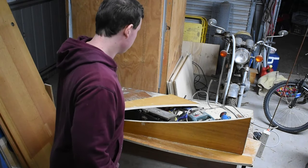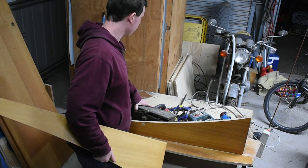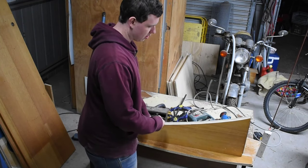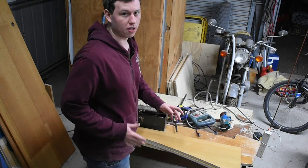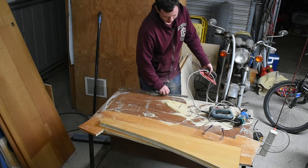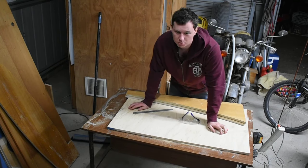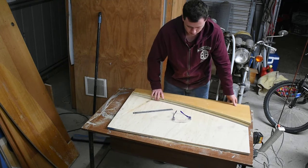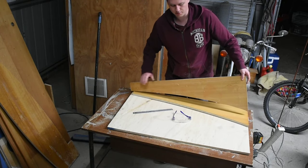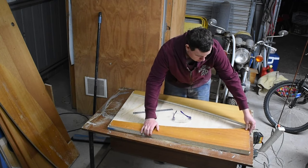What I'm going to do next is these are both the profile of the horn. So I'm going to get the bottom sheet of wood and sit these both on it just to see how the curve's going to fit and what kind of space I've got to work with for tube placement. Routing creates quite a lot of dust. Something I've just noticed after working with this chipboard is that even though it's about the same thickness as the plywood, it's quite a bit heavier and denser — and it's probably not stronger. That's one of the reasons I'm using pine plywood instead of hardwood plywood: it's a lot lighter, and for a PA-type sub, being lighter means it's going to be much easier to move around.